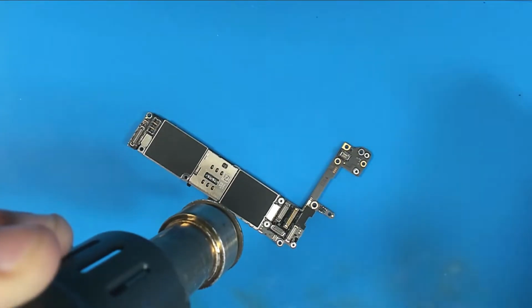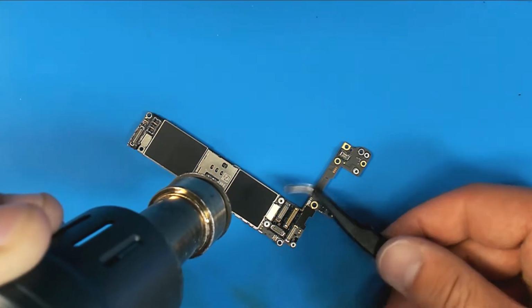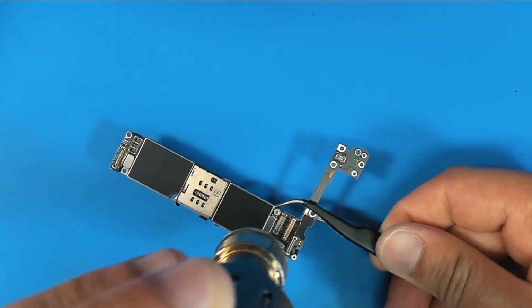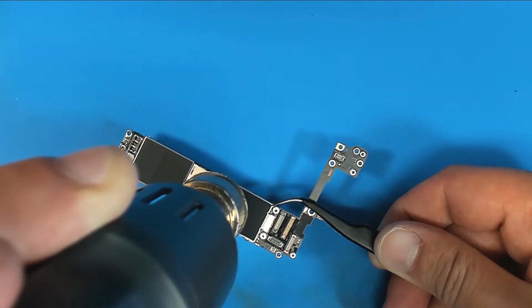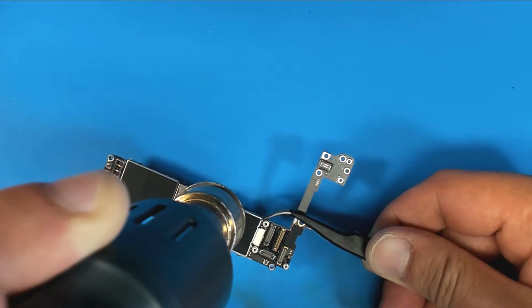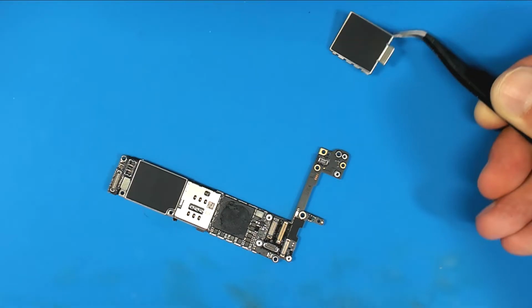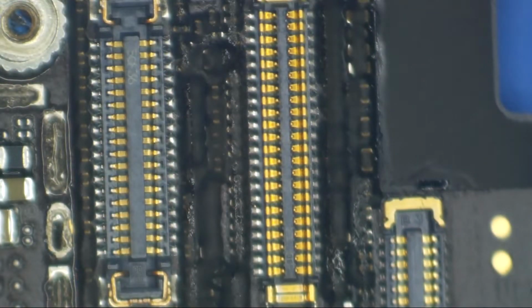It's going to be a little bit difficult to do here. Let's see. Okay, let's just do it. I'm sorry if I missed the majority of this. Well, I don't smell anything burning yet. Many times by this point in the repair on an iPhone 6S that has had a hard short on backlight output, when you start heating up that shield, you smell it, by golly. All right, we've got the shield off. Without wasting any more time here, let's have a look at it under the microscope.